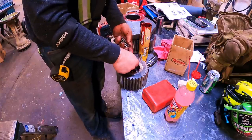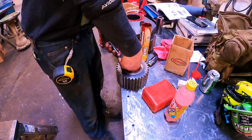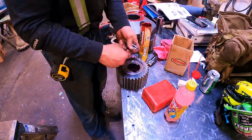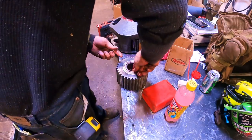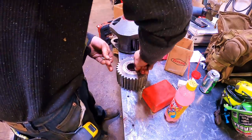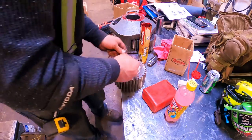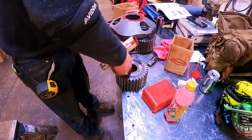And the longer you run it, the worse it gets when you've got a rear end that's howling at you real loud. In the case of this Teammate 4, you've got a rear end where the Diffy Lock's quit working. I will know now to look for this. Now, I complain a little bit about this axle setup, and the reason I complain is because I'm so used to Deere's quality in these axles that it really surprised me that they've done this with that thrust bearing on these Teammate 4s.